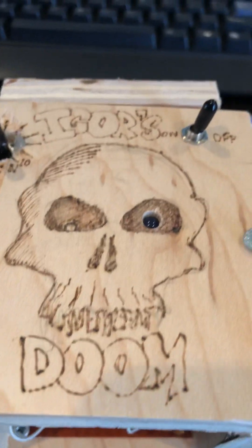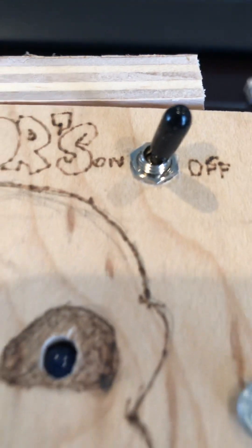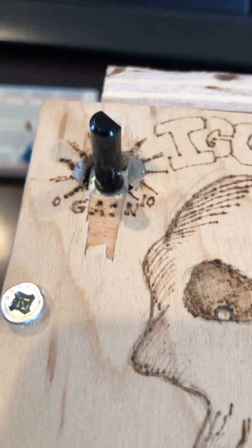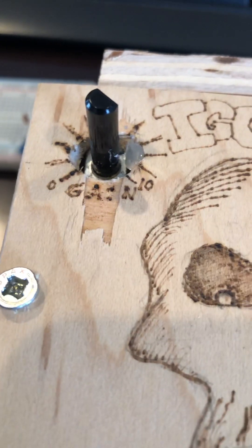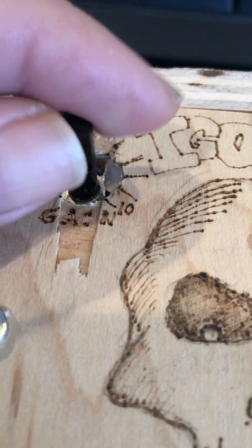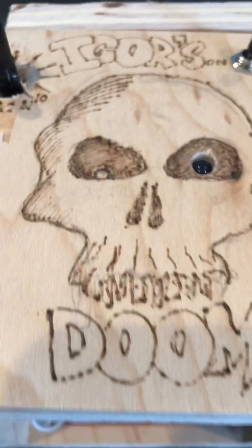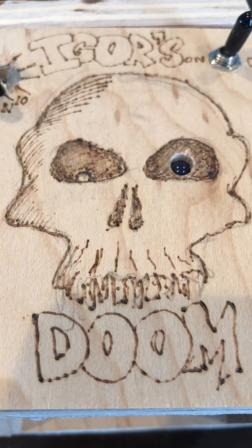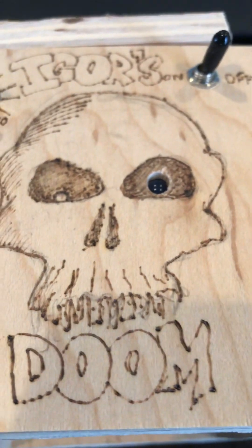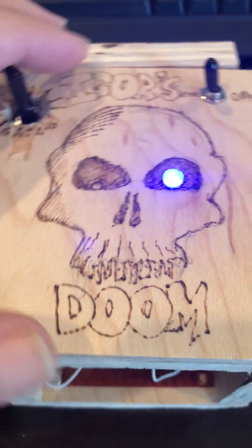I was a little creative here — I didn't have a guitar pedal foot switch, so I have this old plain switch that we're going to use temporarily. This is the gain potentiometer, which is wired between pins one and eight of the LM386, and this just swivels back and forth. The on/off switch is there. I used a wood burning tool to make this design on the front just to make it exciting looking, and I wired an LED light in parallel so that you know if it's on or off.